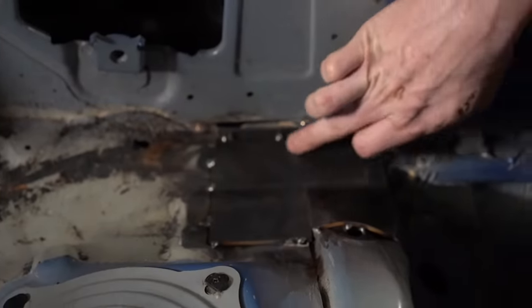Just one thing to note when we're putting these in, we want to line all the forces in the same direction and in line with all of the tubes, so you can see our rear backstay is perfectly in line with our half lateral. And when we do our other tubes, we're going to make sure that they all join into a single junction, giving you the most strength and rigidity that the cage is able to offer.